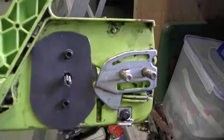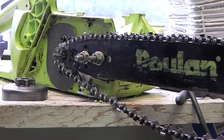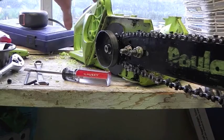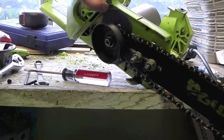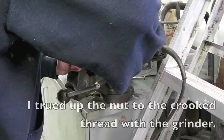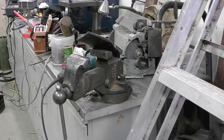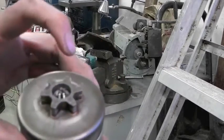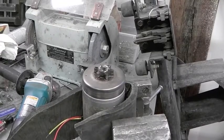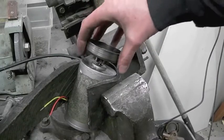The motor is mounted. What I need to do now is see about chain fitment. I mocked it up — it all fits on fairly well. Obviously I still have to sort out the wobble. There is a new problem: the chain is fouling on these Allen bastards. I swapped out the Allen caps for just some round-headed straight-blade screws and they miss the chain. After staring at it for a moment, I've decided to blunder into an easier solution — turn this over and weld it to the nut. As good as it's going to get, and there's an awful lot less wobble to it, so I think that was worth the effort.